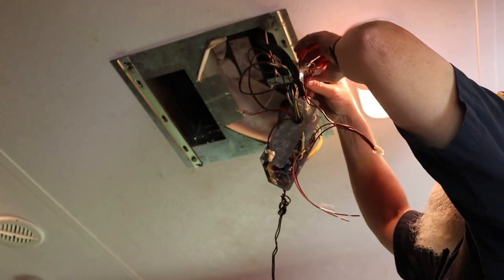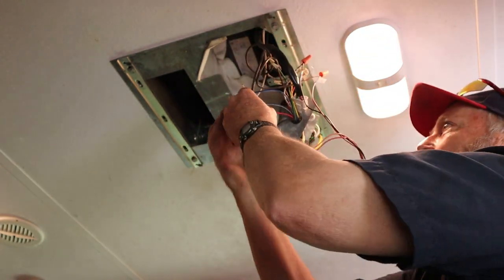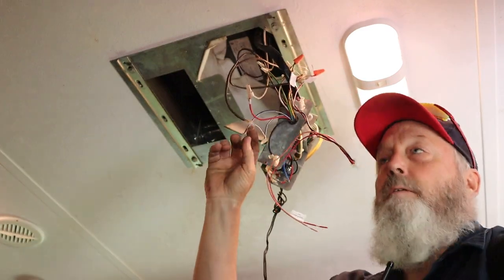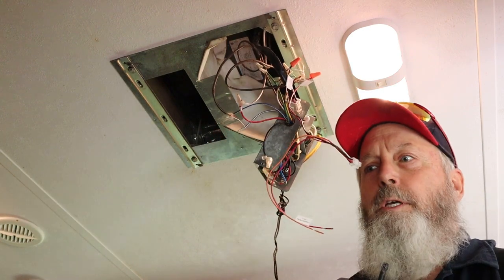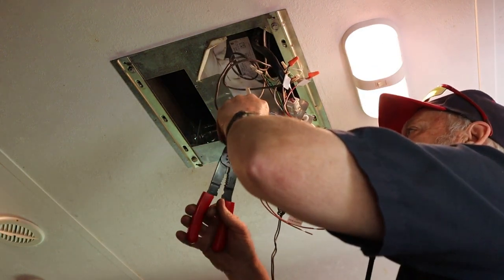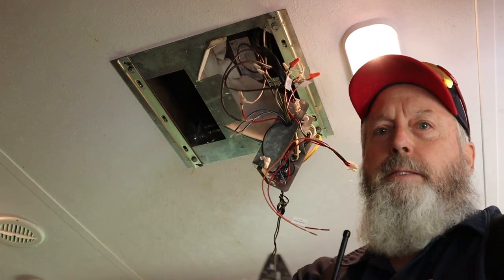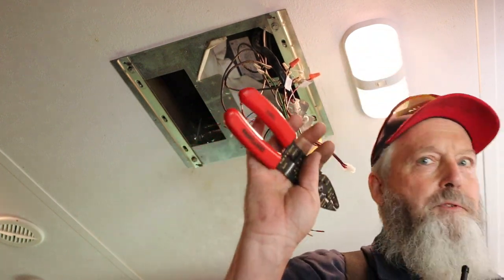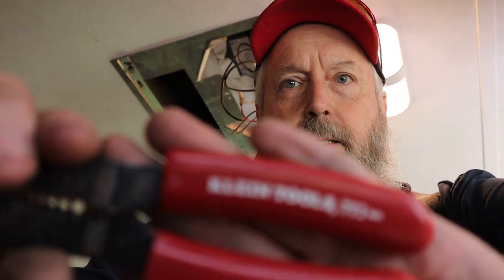You need to notice which wires your blue ones are hooked to coming out of the box. The two blue wires coming out of the box - that is your furnace. That's the control circuit for the furnace. For that, they give us two little spade connectors that go on those and hook to the new control box. I'm going to go get my good Klein strippers. There's a link below from my Amazon store. Go check out those Klein strippers - they're so much better on these little bitty wires. Those are my favorite strippers right now.